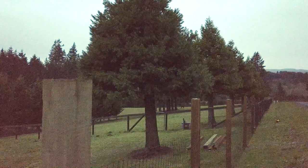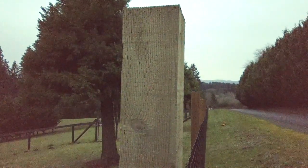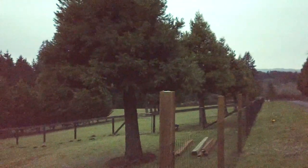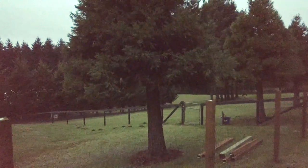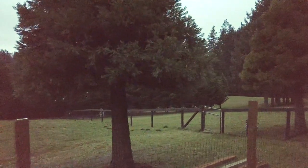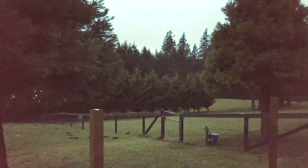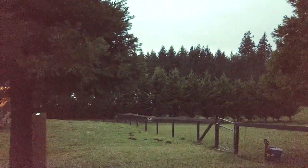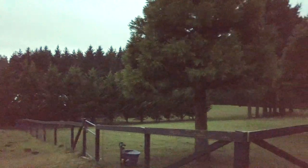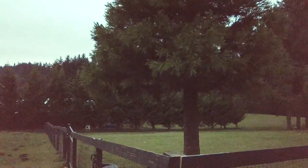It is, if you can see it, if it's bright enough, but I've got it stretched. It's pretty tight. I would say the only downside to this field fence is it's not as thick a gauge metal, so you can't stretch it nearly as tight, and hopefully it holds its tautness. But I put 3 or 4 staples in each post, and I'll put a few more in there, and I kind of hooked and looped it over here.